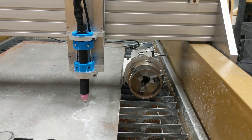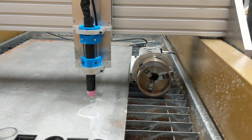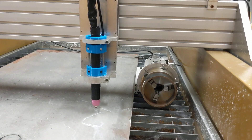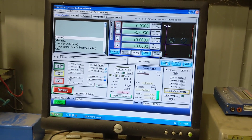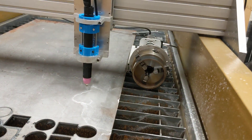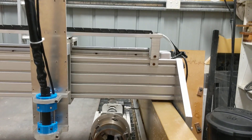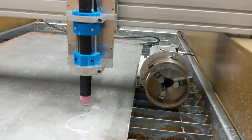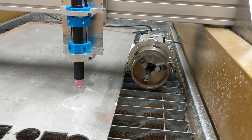It will cut two holes in the pipe and cut off the end of the pipe. My machine goes up and down easily enough — it sits on rails — so I'll lower the table down so the pipe cutter fits underneath the torch head. I'll zero everything in Mach3, regen the g-code and hit start. My plasma cutter won't turn on obviously, but there's a lamp in the background that switches on with the plasma cut, so you'll see when the torch comes on. It has a touch-off probe and I use a Proma torch height controller, so everything should function as it should.